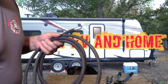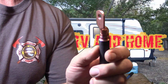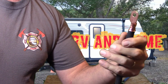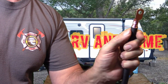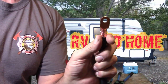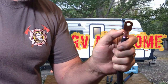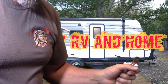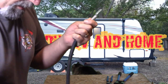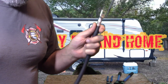On to the 1-0. I'll show you on the plain copper lug — come out and rotate it around just a little bit. It looks really, really good. There is one little tiny spot that kind of started getting pinched. Now, I have heard people say to do a partial crimp and then rotate and crimp again. I tried that and I didn't like the way it came out, so I just went with a single crimp and that seems to be holding pretty good.